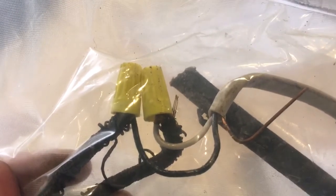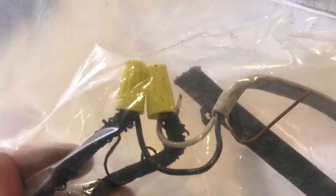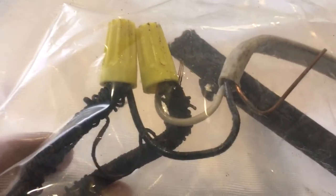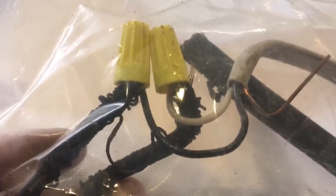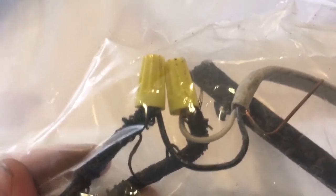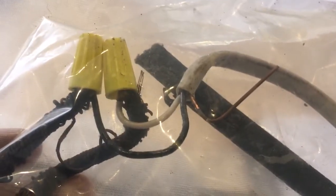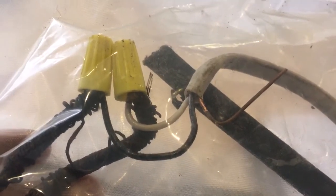Before they were saying that your wiring is all bad, they would say that your old cloth wiring in the basement had to go away. They would just go through and run new wire — this is what you see in the basement — and they would throw this up in the wall cavity, because knob and tube wiring was always spliced in the wall cavity. You'd come and be like, oh my house is all new, and it would be all new wiring downstairs, but you notice that wire is not attached to the ground wire.